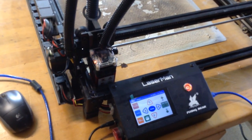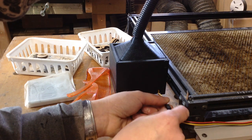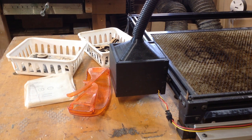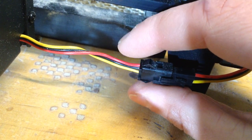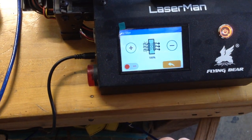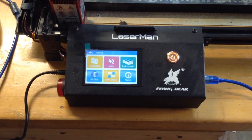Then I had a lot of problems with the machine. It was cutting things elongated. And this was also when I started playing around with the wires for the air filter. I probably didn't make this crystal clear in the beginning of the video. These wires are supposed to be permanently attached, and when they are, the air filter only works going through the panel. But for some reason, if I very lightly touch them like you see in the video, I can get the air pump to be permanently on. That was a workaround in order to get this to work for the machine. I don't really know the inner workings of the electronics of why that is the way it is, but for the winter, that is how I got it to work when I used it to cut, and then I just completely unplugged them when I was done working.